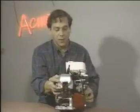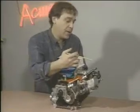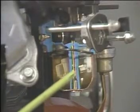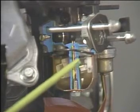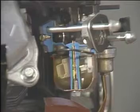Connected to the crankshaft is another shaft with bumps on it. The shaft with bumps on it turns at half the speed of the crankshaft. As that camshaft turns, the bumps are made to open a couple of valves at the top of the cylinder. The one at the back opens a passageway to the carburetor. The carburetor has a small nozzle in a pool of fuel, and as air rushes past across the top of it, it sucks a small amount of vaporized fuel with it.